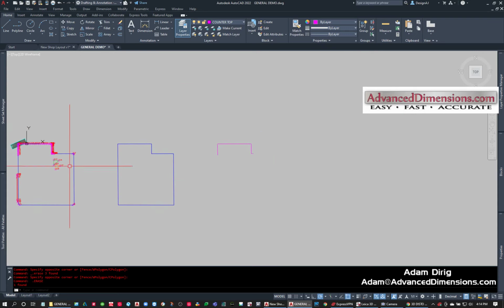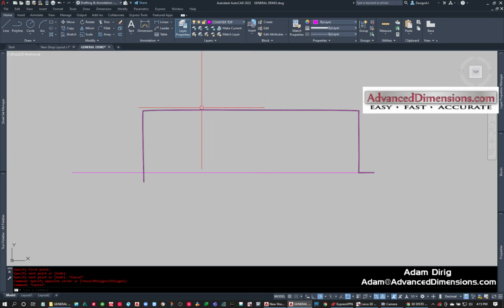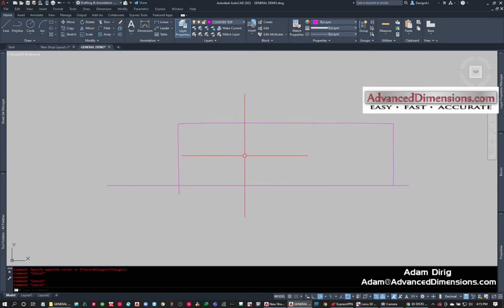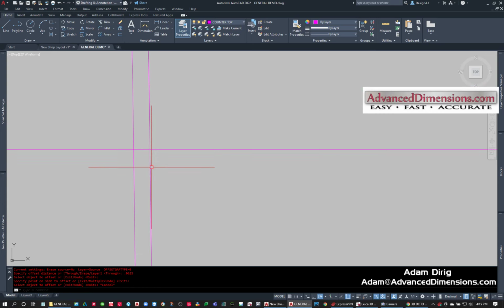So that's one concept. The other concept is like this countertop, where actually I want to follow the contours of the wall. So my countertop is supposed to end here, right? And then I want to say, hey, I want the countertop to be cut to what's going on with the wall, but I actually want to cut it at about a 1/16 of an inch offset. So I zoom in, I offset towards the inside, and then we do some trimming AutoCAD work here.